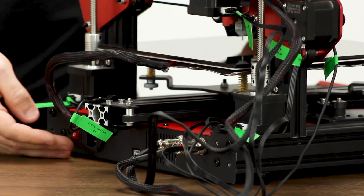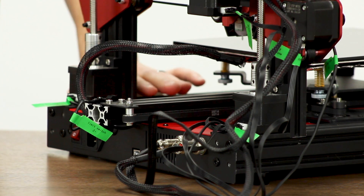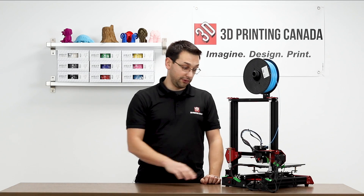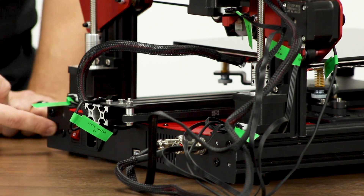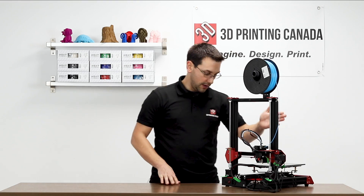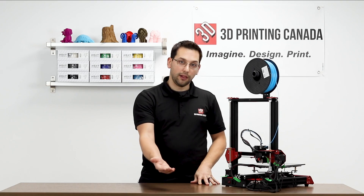To replace that sensor, we had to remove the entire board assembly from underneath the bed of the printer. On that previous video as well, I had some difficulty getting this entire unit out. We had loosened or removed the four screws on either side, and then you had to loosen the screws on the middle 40-40 rail on the one side to allow it to slide out.